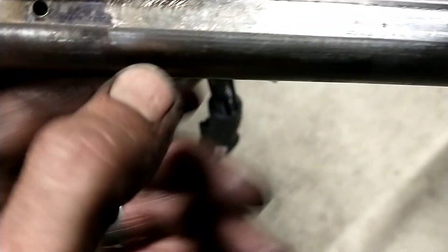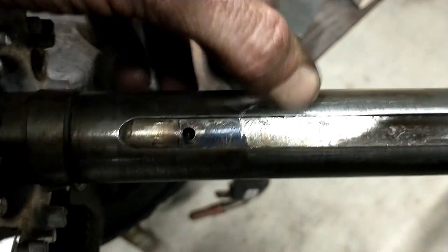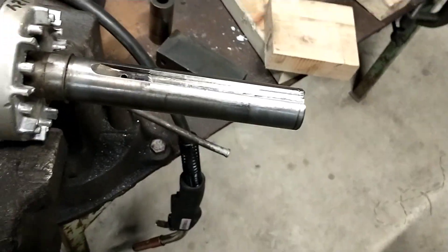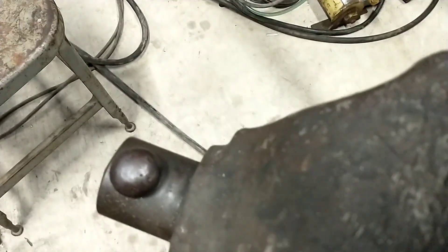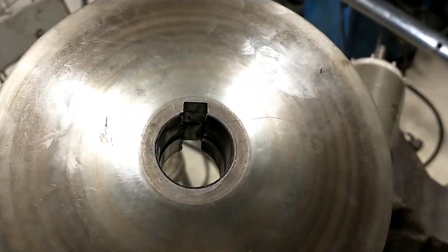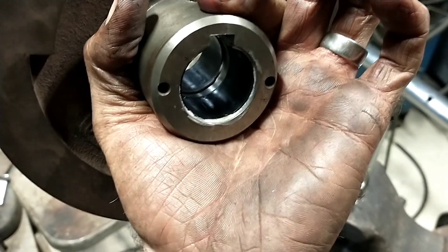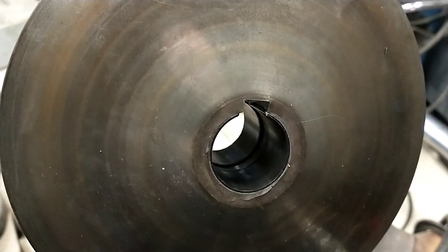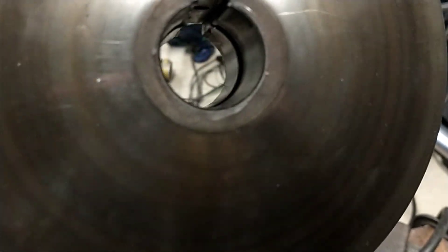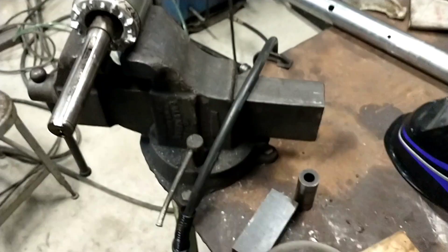It came out just fantastic. It was worn back probably to about here down this side, and probably a 32nd or so missing down that side of the key. We've got her spiffied back up. The pulley that runs on that actually doesn't want to go on right now — it's a little bit on the snug side — but that's not the fault of the shaft, it's because I just put brand new bushings in here. It's a synthetic bushing material and you've got to epoxy them in — there are a few tricks you ought to know about that, but I just didn't have time to show that today. They're quite commonly a bit fat down around the middle where they've got a little rib on them on each end. So it's pretty common to have to go in with a fine half-round file and just touch that down in right along where that center groove is, and then it'll slip on.